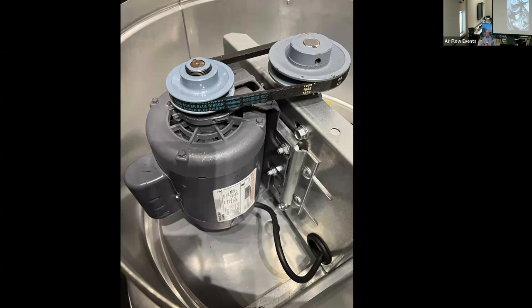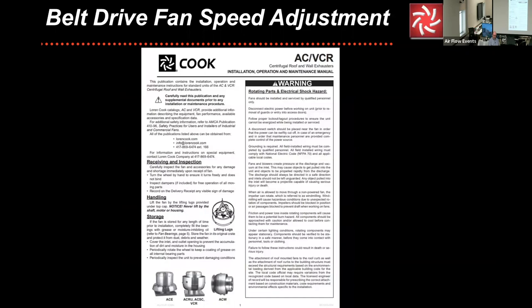Why? There's actually cords inside that belt. I have been in experimental belt labs where they develop it. You will break those cords inside the belt if you use that. That's why there are devices such as the motor slide base to take that tension off, put that on and off. I know what's done in the field. You have to be very careful so that you do not affect the belt life. The other thing that gets into play is you have to keep that belt alignment.